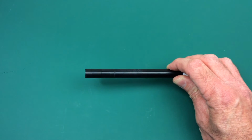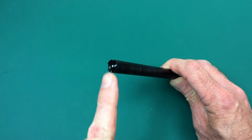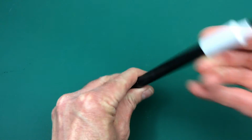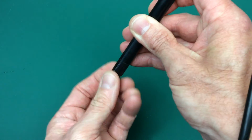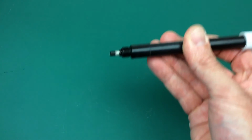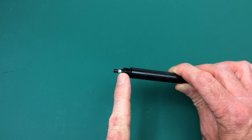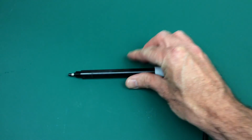If you find you can't achieve a stable reading, the problems usually lie with the membrane. Now, it could be split, it could be damaged if it's been used in a pond and hit the bottom and it's been cut on a sharp stone, so you may need to remove and replace the membrane with a new one. And again, if you can't calibrate, check that the anode and cathode are nice and shiny and clean if necessary.